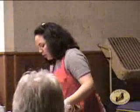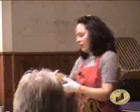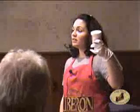There is something called button shellac. If you've seen that, I think Bob actually has some in there. It's big button form, and that gives you a nice brownish orange. There's orange shellac, which is the most popular, and then comes the Primo Cadillac of shellacs, the blonde. This imparts a very light color, a little bit of warmth, and it's again the most refined. So this will be your most expensive.